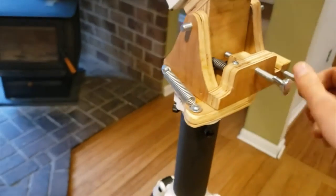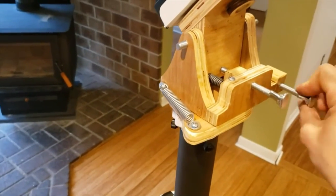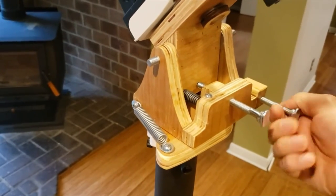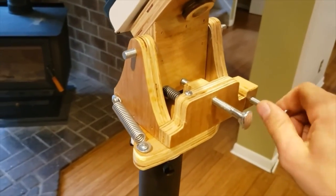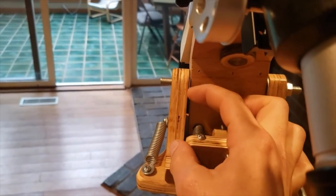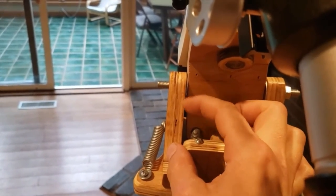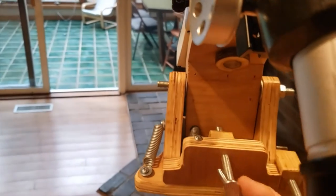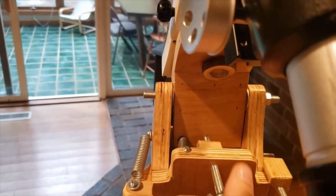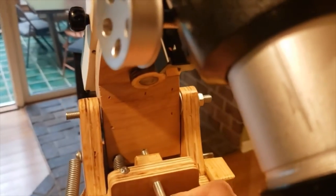The azimuth seems to work great because it has a lot less tension on it — I'm happy with that. I think what would also help is that I polished these washers to make it really smooth and silky, but I probably actually want some friction on there, so I might put some grubby ones in and maybe extra ones to make it tighter.